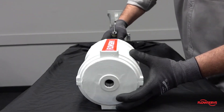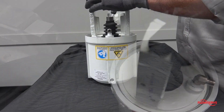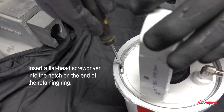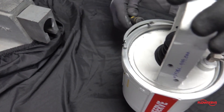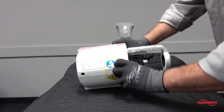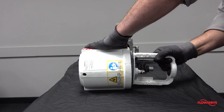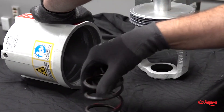After the adjusting screw is removed, it is safe to remove the cylinder retaining ring found on the underside of the actuator. Insert a flat screwdriver into the notch on the end of the retaining ring and pry the retaining ring up, working it out of the groove all the way around the cylinder. Lay the actuator on its side and move the yoke up and down while pulling the yoke, piston assembly, spring, and spring button out of the cylinder.